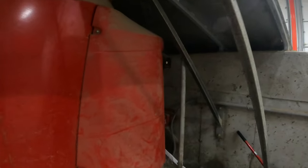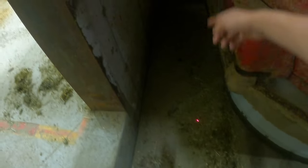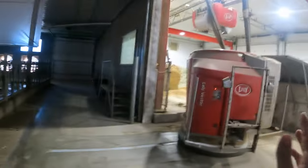This helps the cows be more healthy and helps them thrive better here in the dairy. The MFR has a few features that help it drive around the barn. When it's driving around the barn, it has a laser on the ground — this is the side the feed comes out of and dumps out of. The laser will scan each individual group of cows and tell the robot what it needs to feed next.